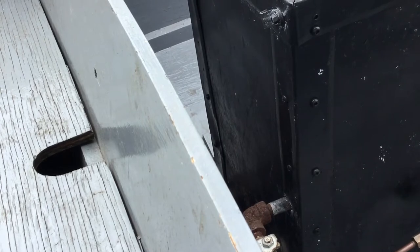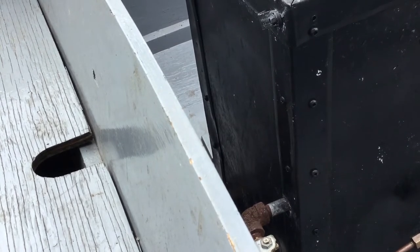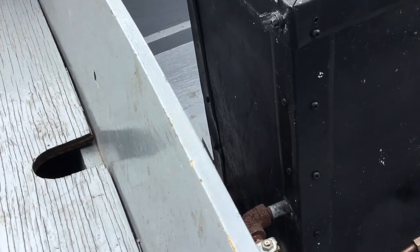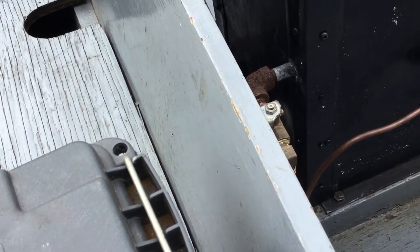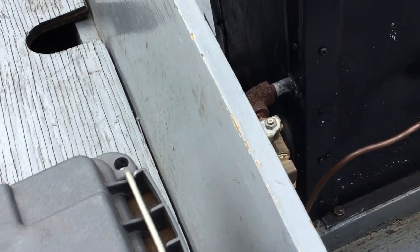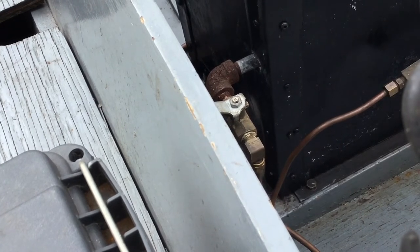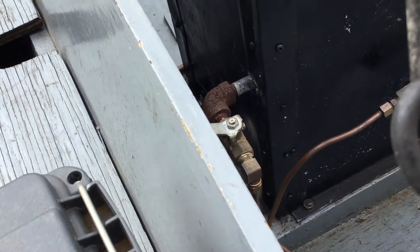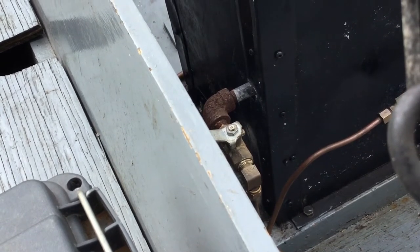You're running regular super steam 600 cylinder oil. You can also run straight-weight 30 in the drip oilers — these two work; the third one is capped off. I don't know where it went, and the other owner who had it didn't know either. With the brass box here, I think two of them go down to the crosshead. For whatever lubrication points, use straight-weight 30. You'll see holes there for the fulcrum arms and the water pump.